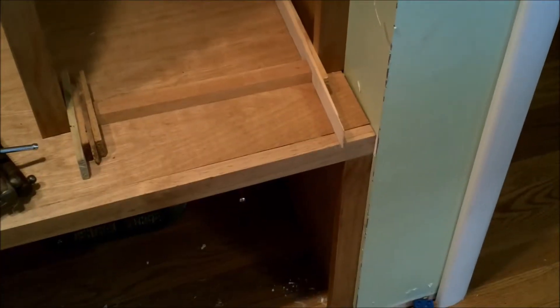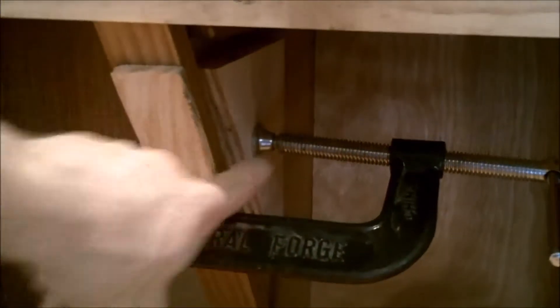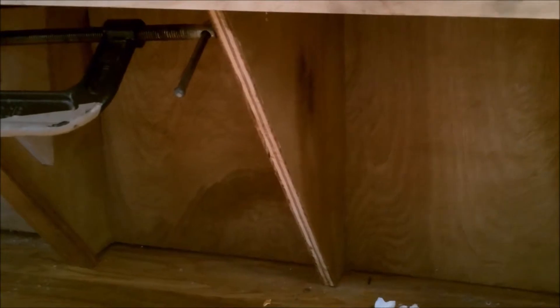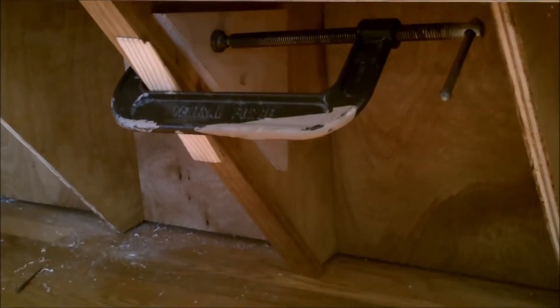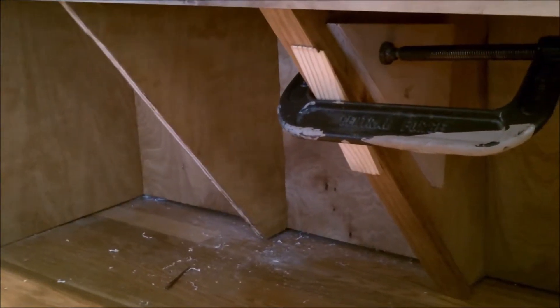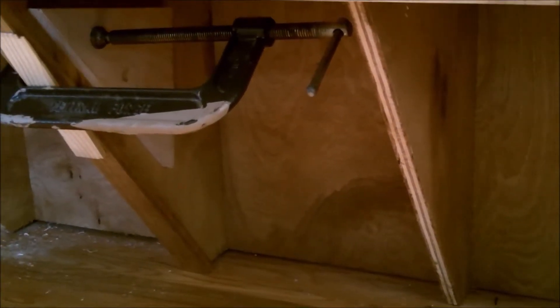Also did that vertical down at the bottom right there and I got the same prying situation right there down at the bottom. I have the system I developed a little bit ago where I'm clamping onto the existing plywood and shimming against the clamp to put pressure inward and upward on that board there that's covering up the plywood. You see a bare plywood end right there and you see another gluing one right there. I staggered them so I have two left to do — tomorrow I'll get that one on the left of the screen and that one on the right of the screen, because the clamps won't be in the way from the other ones.